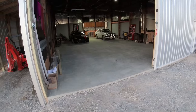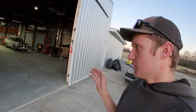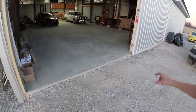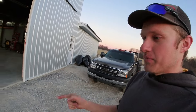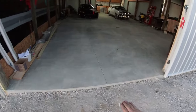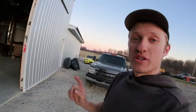My good buddy Craig and his dad came out with J&J Sander Concrete and knocked out this floor for me. The important thing about a shop floor you need to know before your concrete guys come out is how thick it needs to be and what machinery you're going to pull into your shop. My floor here is six inches thick and I have a 20-inch deep footer along the entrance of the building. Knowing I wanted to drive my bulldozer in here, that footer prevents the slab from kicking up — if you drove on the leading edge of the concrete it would push it down and pop the back up, even with six-inch concrete.